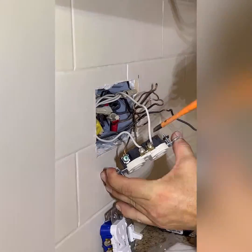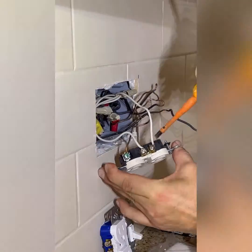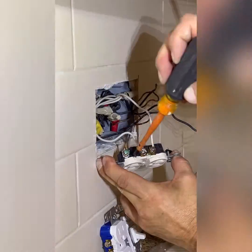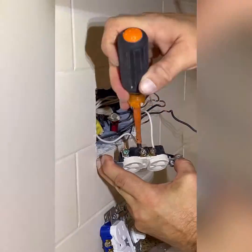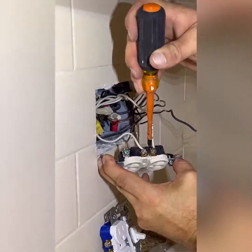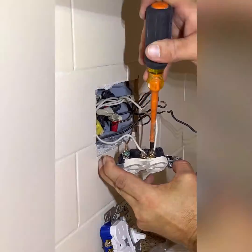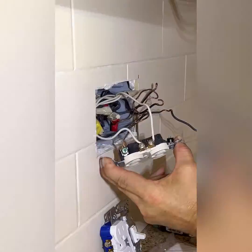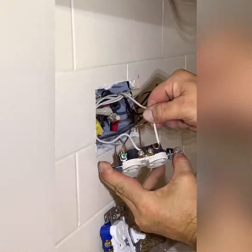The wires should be wrapped around the screw terminals clockwise. Think of it like a clock — one, two, three, four — clockwise. Everything goes clockwise when you put wires on in the correct direction. Use a flat tip screwdriver to spread out the wires and unhook them from the screw terminal.